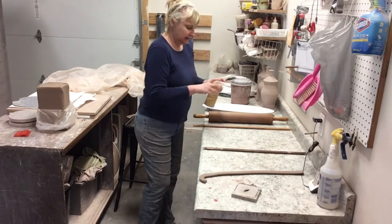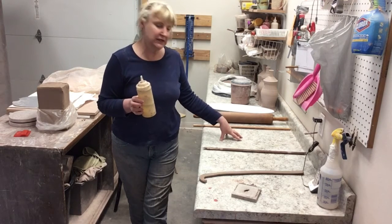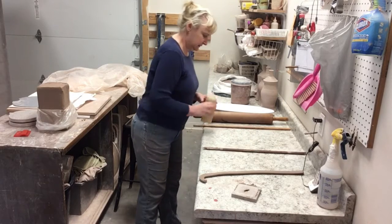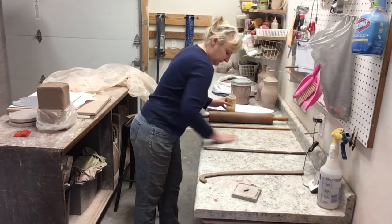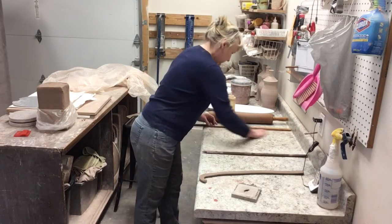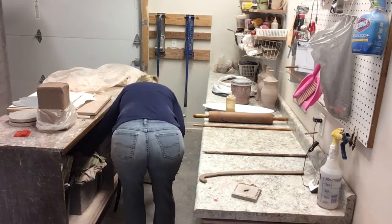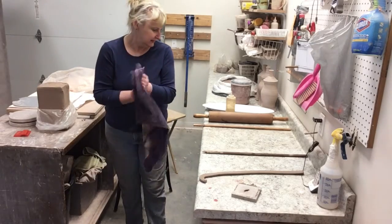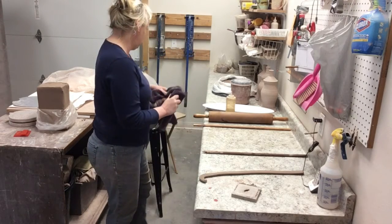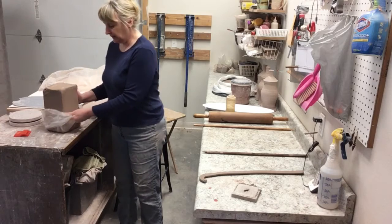I'm working off of mica. I get WD-40 in great big gallon containers — we go through a lot of it, but that's what we use as our release agent on our countertop. We pour it into a squirt bottle because it's much easier to work that way, then just put a light coat on the countertop. Some people use Pam cooking spray, but I found it gets a little sticky and it's not my favorite release. WD-40 is the one I prefer.